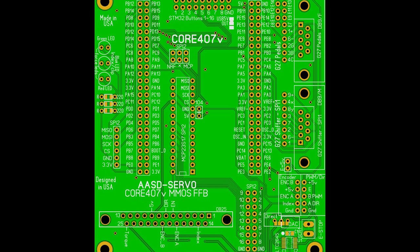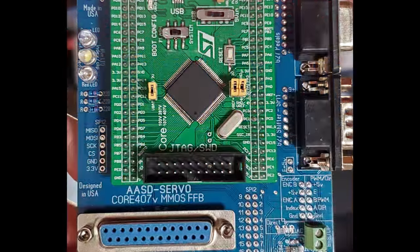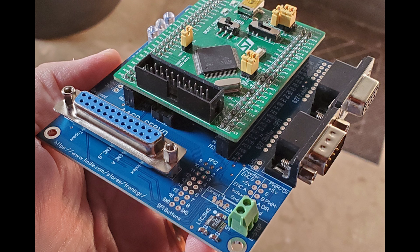So since starting this project and sort of opening it up to the Xsimulator community, there's a few things that have been done in the meantime by the likes of Thanos. He's made an adapter board that will eliminate all the wiring, basically, and you can just plug in an STM32 board, not the Discovery, it's a different board. It's still a work in progress, but the good thing about the board is it has a built-in DAC spot, so you can solder a DAC onto it, digital to analog converter. This gives you a clean signal and allows your motor to run smooth, quiet, with no noise.